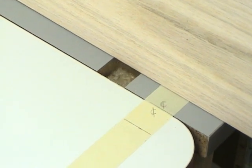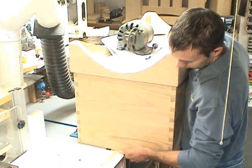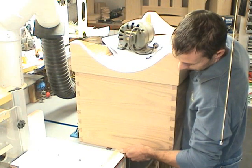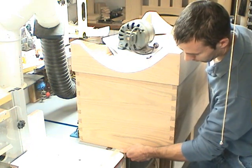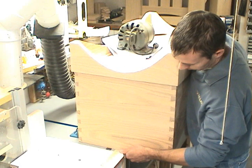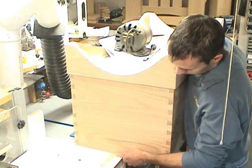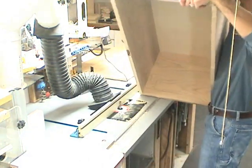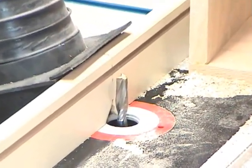I'll do this on the router table. With a half inch spiral up cut bit tucked into the router, we'll move the box back and forth while bringing the router bit up into the work piece with the foot pedal. We need a pretty deep mortise, almost two inches deep, so this is a pretty stable way to do it. I've added a heavy motor on top just to keep the box steady on the router table. I move the box back and forth and gradually cut the mortise. Here you can see how much bit we have exposed above the table and how deep that mortise had to be for the lock set.